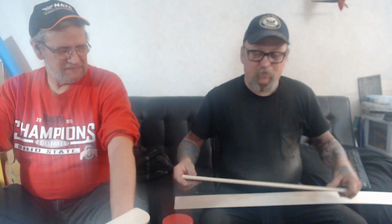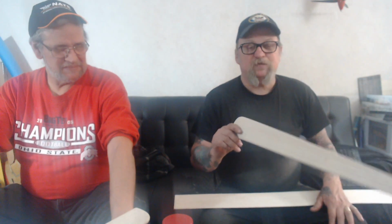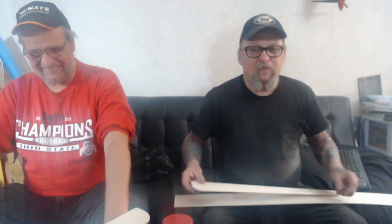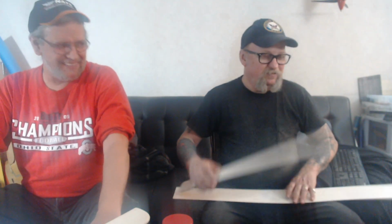I took that other piece from the other side of the wood and flipped it over and put it on here, put my glue on there, and I put it down flat, and I thought, all right, I'm done. Well, the glue dried, the glue was dry, but you could just about see it move. I've already broken the rest of it up and thrown it away. It twisted like a pretzel. It was like a propeller.